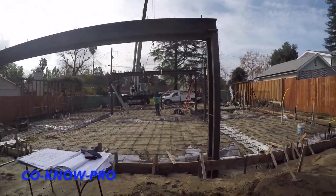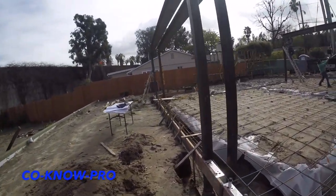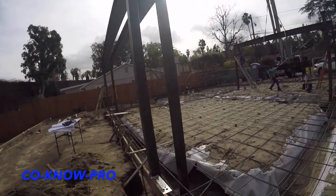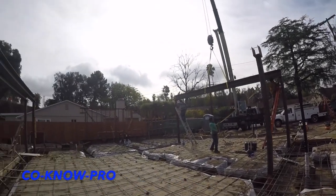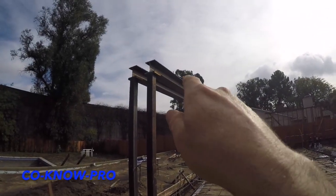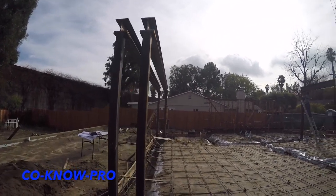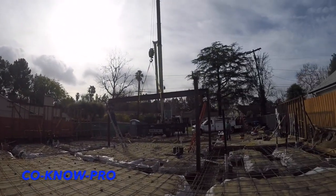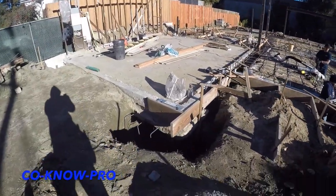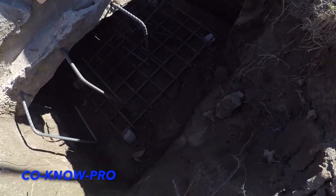The thing about this system is that it's very critical that you pay attention to exact measurements as far as finished reveals. In this house we have 10-foot ceilings and this front I-beam has to have a certain height, but all my trusses for my second floor have to land on top of that I-beam. The other I-beam — my trusses have to land in the web with hangers. You have to figure all that out, compensate your heights, so when you set all your framing everything will line up perfectly.